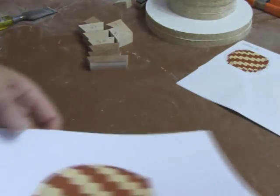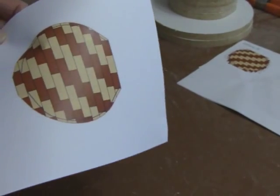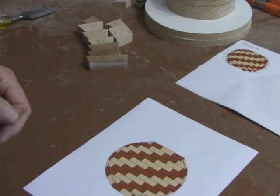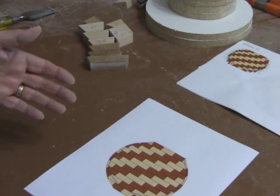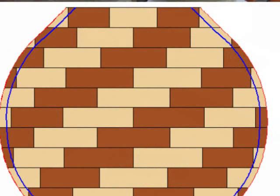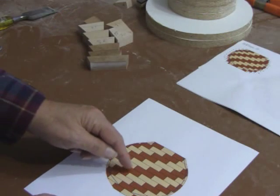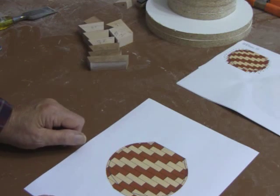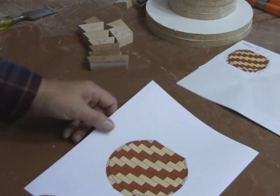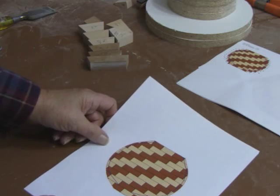And the last consideration I want you to think about is, what do you want your project to look like? That's a big point in it. Now here's a picture of a spherical bowl. It's about 9 inches. This is at 12 sides per ring, and our waste figure is around 29%, as I said before. Now that wraps around pretty fast using a half lap assembly of the rings, one ring to another. That might look like it wrapped a little bit too fast and too tight for you.